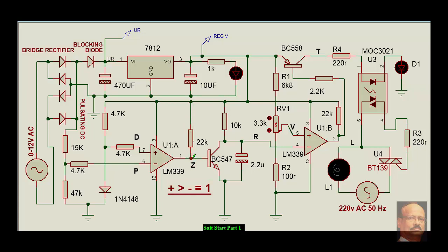When the output goes high via the 22k pull-up, the transistor conducts. Once this transistor conducts, the capacitor — which is otherwise in a charged condition — gets discharged. When the transistor is in the off condition, the capacitor charges up. When the transistor switches on, the capacitor gets discharged. Subsequently, all these circuits follow, and we will go into more details in the discussion stage.